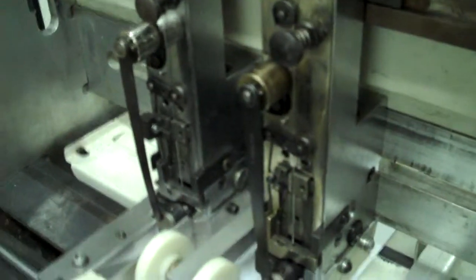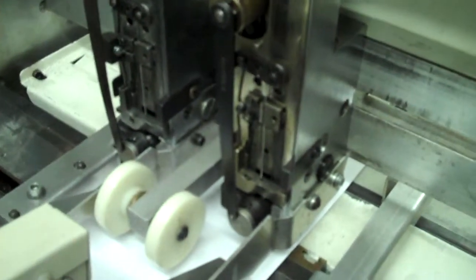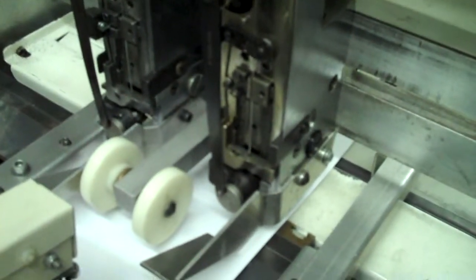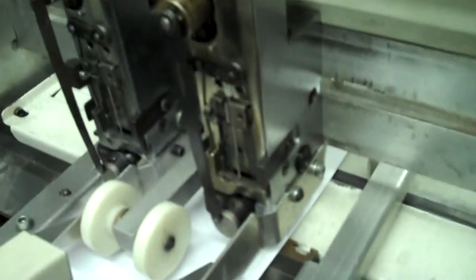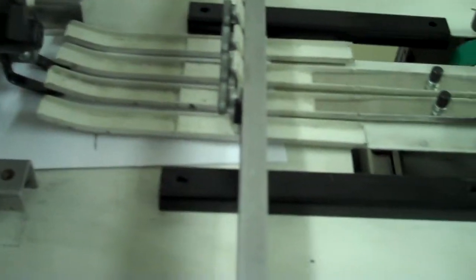Now think about the advantage. If you convert your stitcher to a 4-head stitcher, you eliminate all the issues about running a narrow booklet, and you double your productivity. You run 2 booklets at a time instead of 1. So it's a huge step to make, and something that's worthy of consideration. But you let us know if you're interested in doing that, and we will give you a quote on the price on the parts.